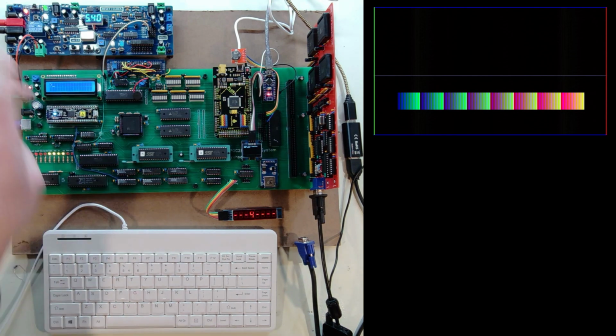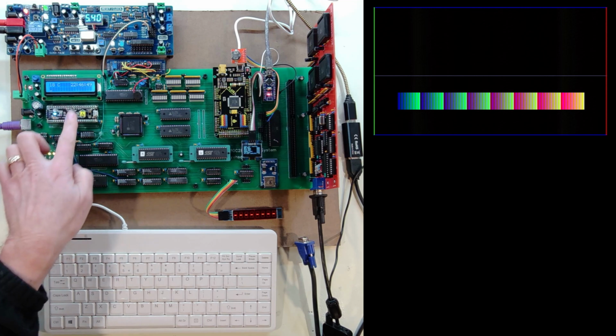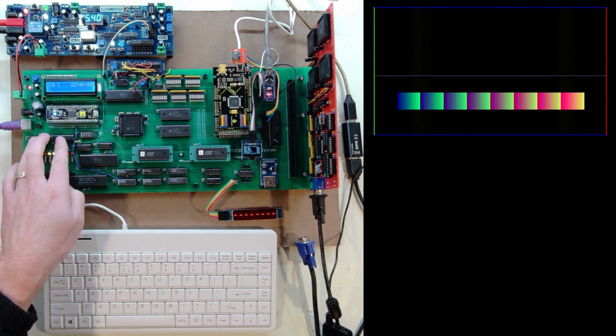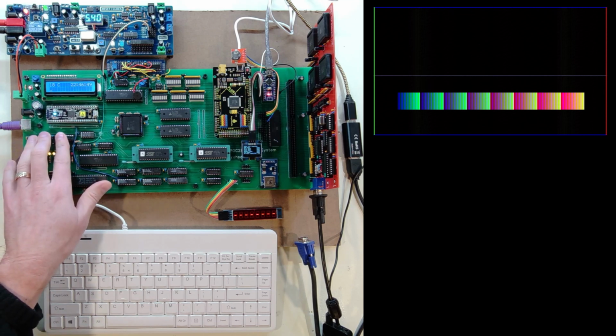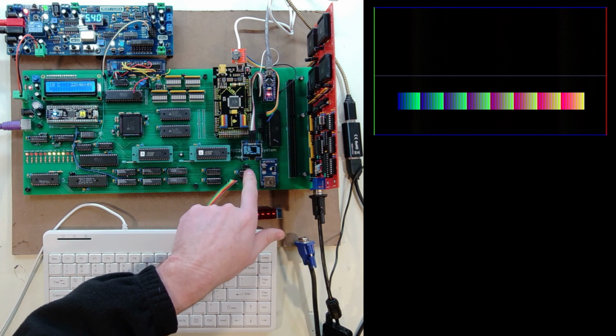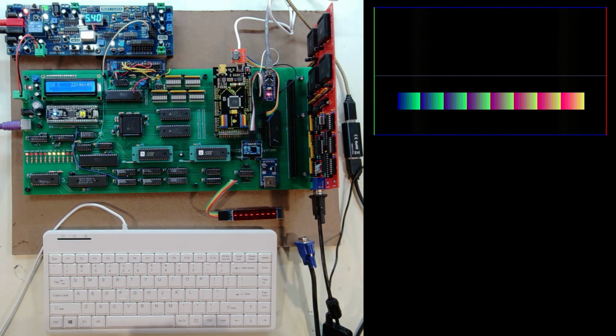So you can see that coming into here, I'm at about 5.4 volts, but by the time I get to the initial stuff over here, it's dropped to maybe 5.2, which is comfortable for these chips. I'm not worried about that. And when I'm down here, I'm probably down at like 4.7, 4.8. So that's how much of a drop I've got going on.